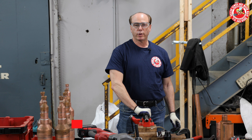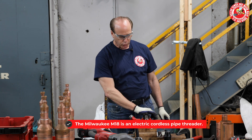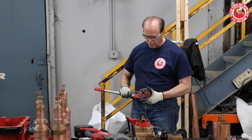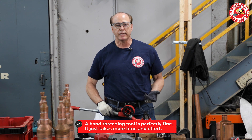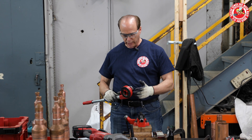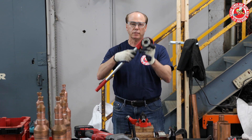This is a piece of three-quarter inch iron pipe that's been cut, been reamed, and it's ready to be threaded. You can use a hand threading tool. Regardless of whether you use a hand threading tool or the cordless, a big key to having a long-lasting tool is to apply plenty of oil because heat does build up. If you don't oil it through the whole threading process, you will burn out the teeth.